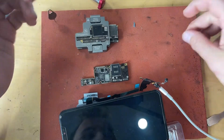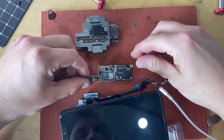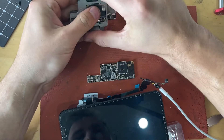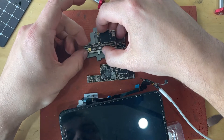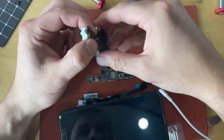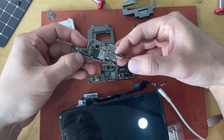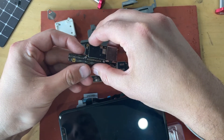I'm gonna explain this like you don't know what it is because a lot of people won't. Basically with iPhone X and newer you have a board that's pieced together — there are two halves. You've got a top board and a bottom board, and you can see these tiny little dots around the outside on this part, which is called an interposer, and they connect the top and the bottom together.